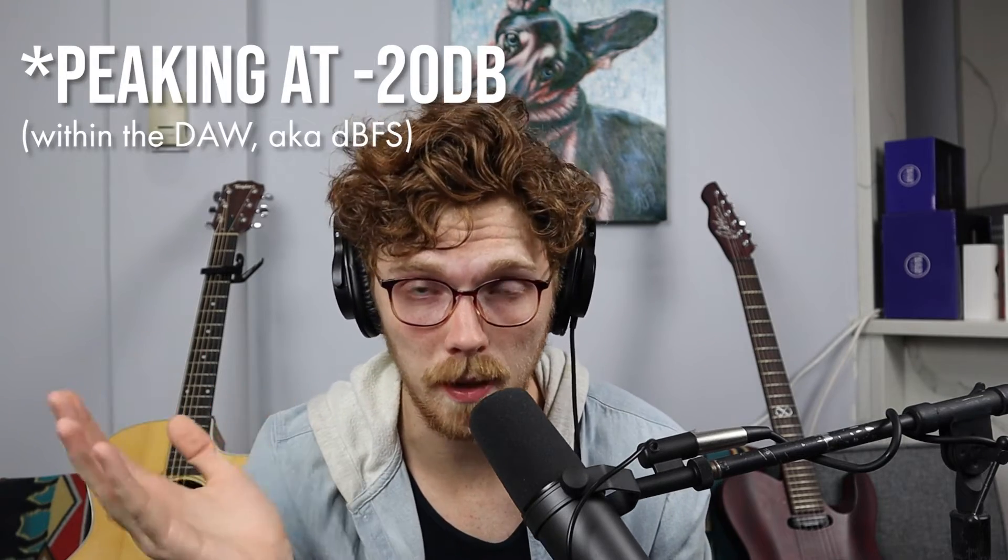So there are two different scenarios. There's the scenario where you're pumping the full 60 dBs into the Shure SM7B — granted you can even reach that — and then there's the scenario where you're peaking at around negative 20 dBs. If you put it through a vocal chain at the full 60 dBs, your noise floor is going to be way more apparent than if you run it at around negative 20 dB peaking. Either way, this is solved with a gate. It's going to be more noticeable with the full 60 dBs, but both ways we're solving it with a simple gate.